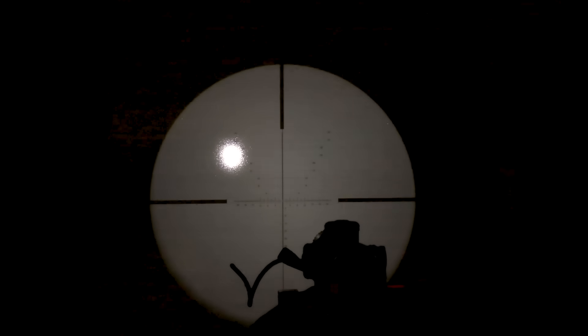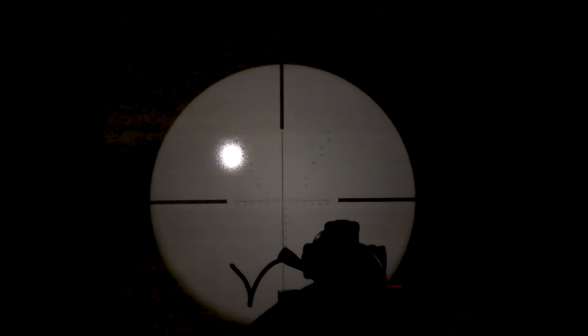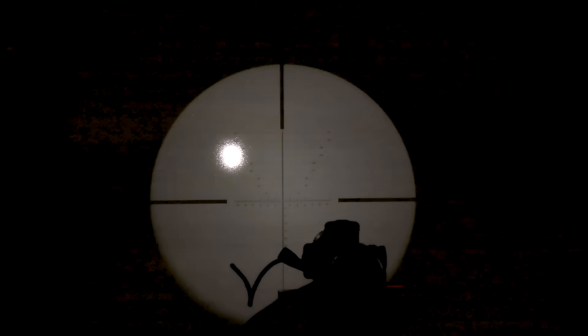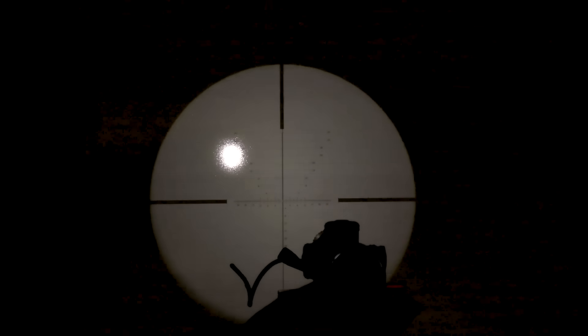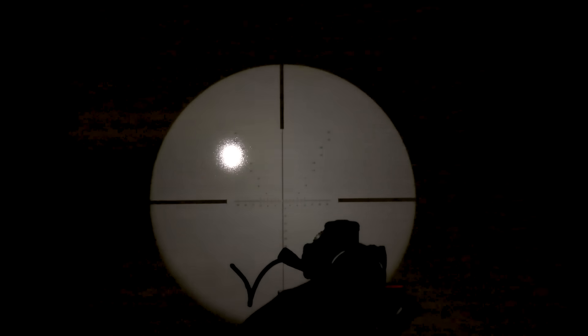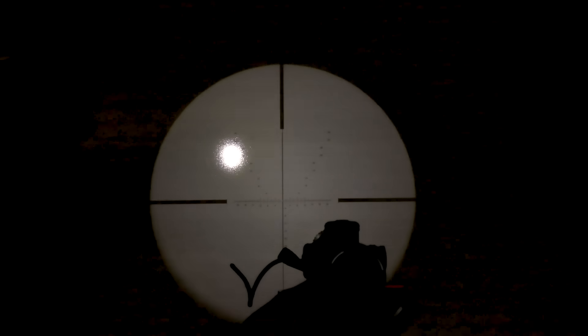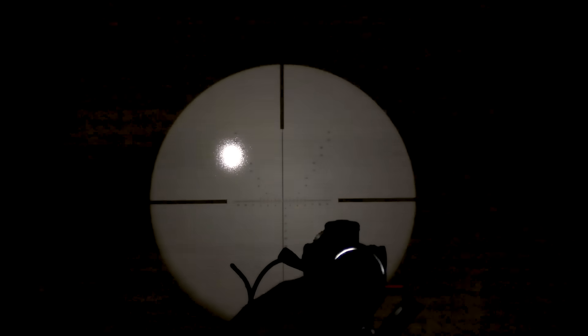Final torque applied. Check the rifle to make sure it didn't put any bias in — and that's good. We are on the level. It's that simple, and it's a very quick way to do it. It is actually super accurate. You're using some pretty basic stuff here at the end of the day, and while it's not the most complex thing in the world, it definitely is important.